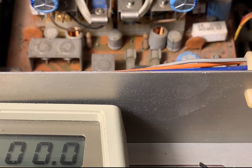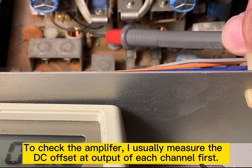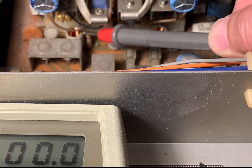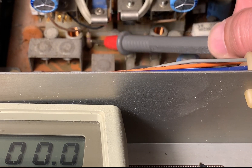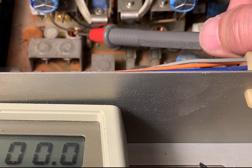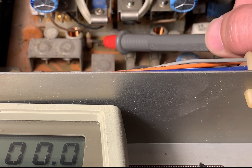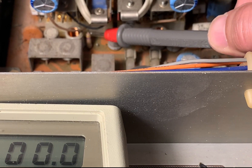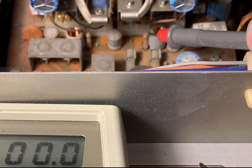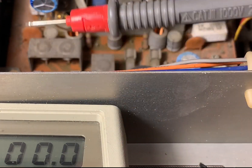I'm going to check the power amplifier to see if that causes the light blinking. To check the power amplifier, I will usually measure the output. You can see this inductor here — usually there's a resistor with this inductor. The left side output is right here and the right side output is right here. This is the voltmeter here.